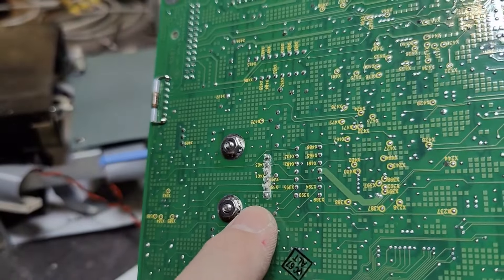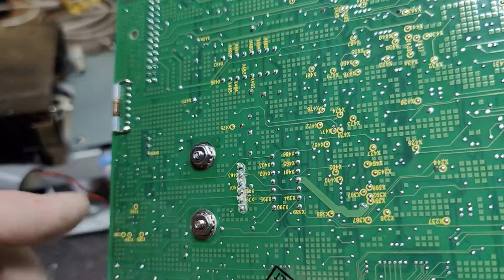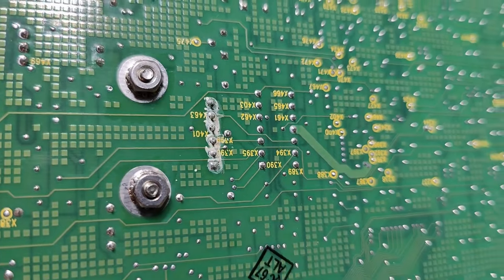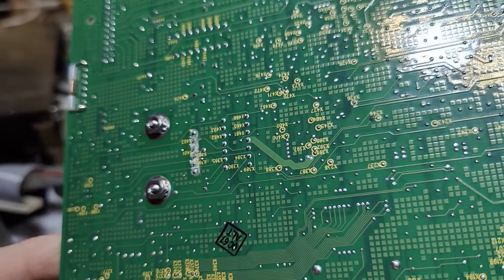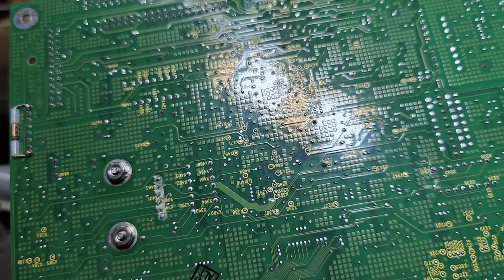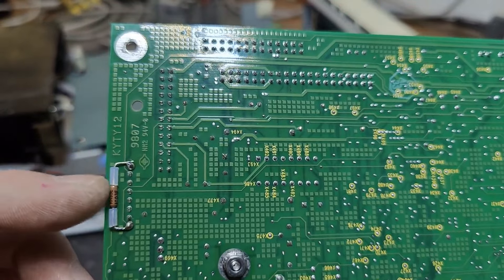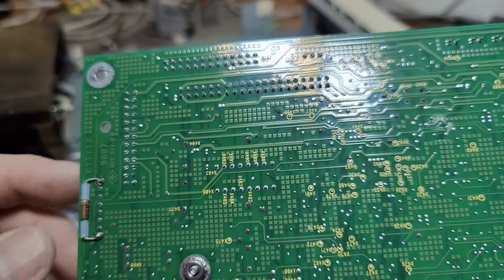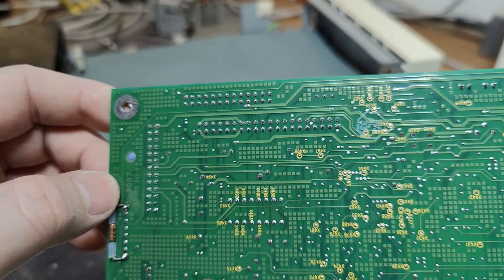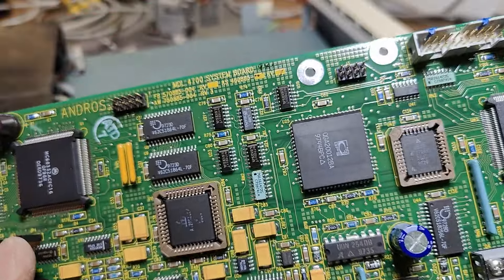This is probably a problem — somebody hand-soldered this pressure sensor and forgot to clean. This could actually be why it was thrown out, because that sensor definitely is not working. You need to clean because moisture will affect stuff like that. And look what I found — one little hand mod, neatly done with Teflon. This design is from 98, and I found a lot of ICs from 97.